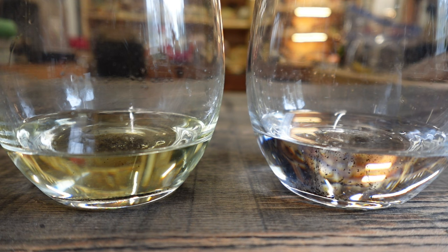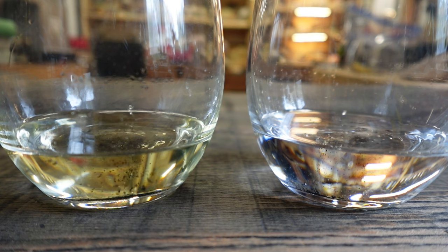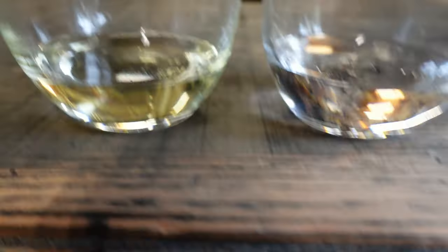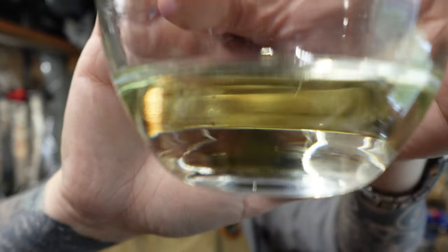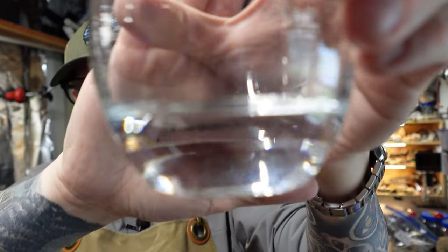It couldn't be more dramatic, the difference between these two. The one on the right actually has a fair amount of magnetite just sitting on the top at surface tension level, floating there and then slowly falling through. The 70 NF has everything settled at the bottom, while the store-bought mineral oil still has some floating at the top — and magnetite is heavy. Imagine your lighter-than-magnetite grindings from cutting rock suspended in that thick oil.